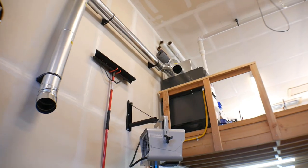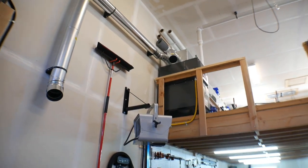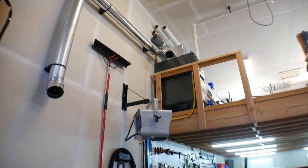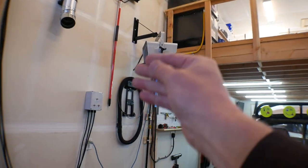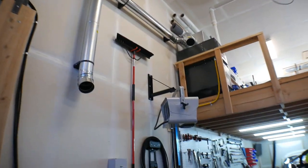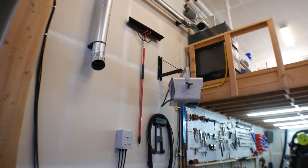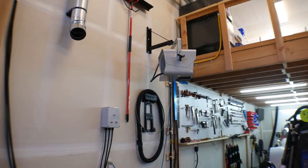These two floor vents just haul out of the floor here and really warm up the area under the loft. I don't have long flowing hair, but just to get an idea of how much they're blowing out — if I stand underneath these two, you can see it blows my hair around. By the way, I told you the furnace cost $200, but I paid about $600 in parts to install it — the gas piping, the flue vent piping, and the ductwork. So the total installation was about $800, and all those little pieces add up real quick.